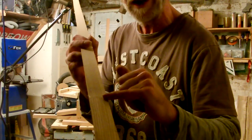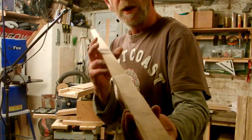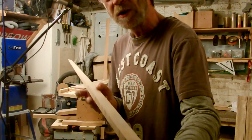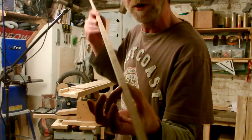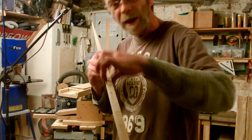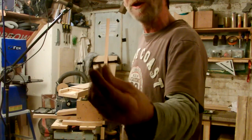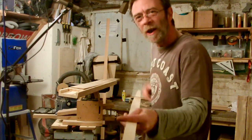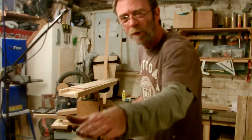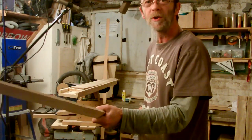down on the flatbed sander. We want to take it down to exactly this level here. Then what we'll have is 10 millimeters, it's 10.2 here at the moment, just beyond that dip. We'll end up with a laminate 10 millimeters in the middle and approaching the 2 millimeter section at that end. We can take that a little bit further down on the flatbed as well, if there's any lumps and bumps in there, and we'll take it on nice and smooth.